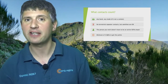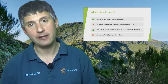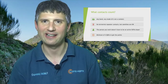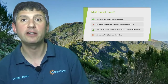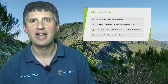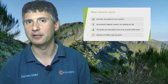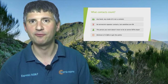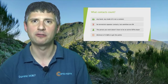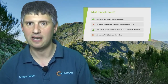If you've only got VHF gear, that's fine as well, as long as you're operating simplex. If you really wanted, you could take a laptop for FT8 to the top of the hill, or a satellite antenna. One of the reasons I generally use CW for HF SOTA activations is because you get so much more efficiency at low power from CW. With voice on SSB, duty cycles are such that you're rarely operating at your rig's maximum power, which if you've only got five or ten watts is not ideal.